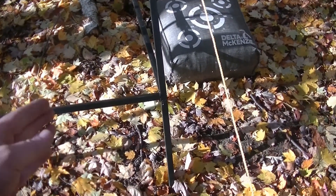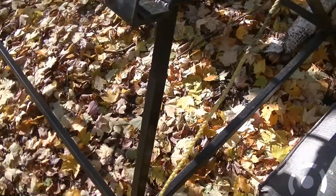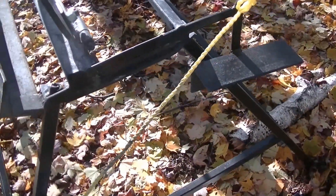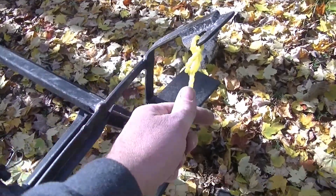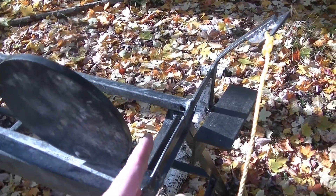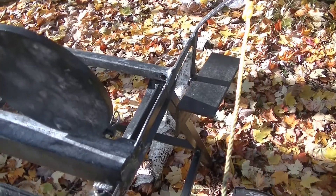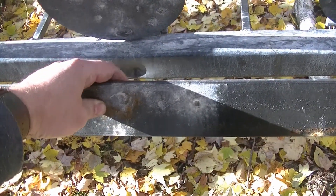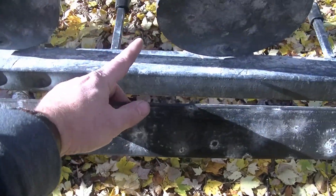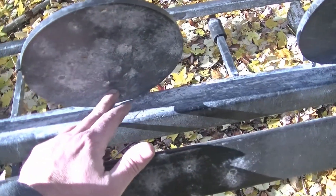Sorry it's a little windy, but I'm out here today with the target so I thought I'd show you. It's all welded up on the bottom and braced. I got rid of the all-thread here. It's not quite on even ground but it's pretty sturdy. I just bent the reset mechanism on purpose over here — it should still work just fine. What I wanted to do was get the rope away from the target because it was lined up pretty close, and a stray shot to the right could destroy the rope. The target works great. You can see the bar here is protected against some low shots — some of these probably would have taken out the reset bar back there, and some would have hit the bolts and ruined them on the targets themselves.